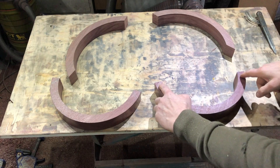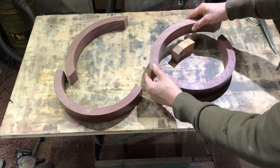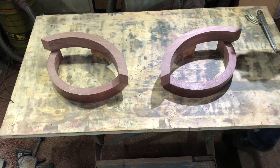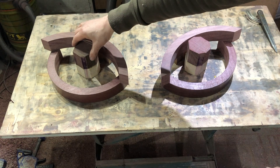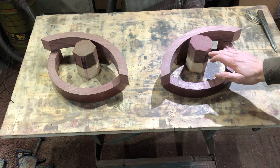To give you a better gauge - I haven't trimmed these yet, I need to trim a bit off the corners. I use the bits I cut out just to prop these up. These will be coming down on here and then filled with resin, but I need to get the angles right first. The corners that I cut off for the large fusion bowl - the larger pieces - I've cut the circle to use for the pupil, and added a bit of scrap wood for when I do the turning so as not to put any sort of hole or chuck grip into it. I can put the hole into the scrap, turn the pupil which will sit just below the resin. I'm not even going to use all of that purple heart - that'll go dead centre right up next to the eyelid.